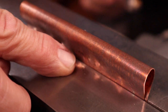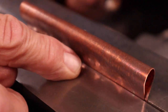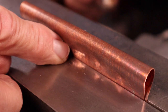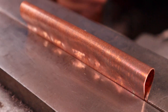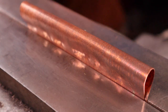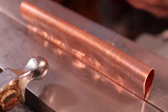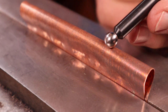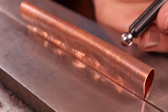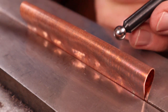This will start work hardening the bottom part of the fold, and it will help hold up the rest of the material when I start hammering on it. Now I have a series of dents along the bottom, and this will have work hardened this bottom section. So now I can take and start hammering on the top section of the fold, making some random dents. I'm going to be using my chasing hammer to hammer those areas down instead of the dapping tool, because it can slip off fairly easily, and it's much faster with the chasing hammer.